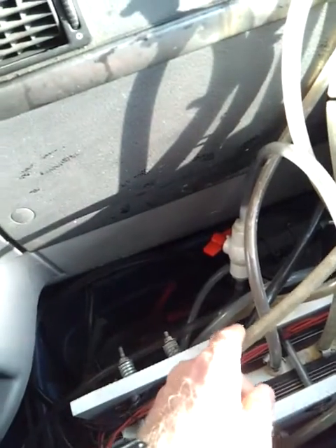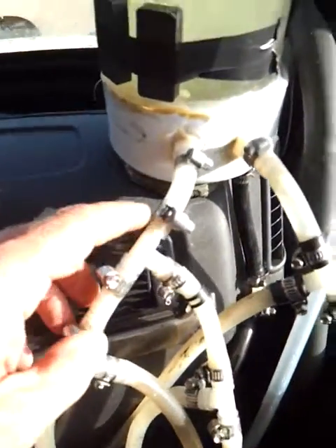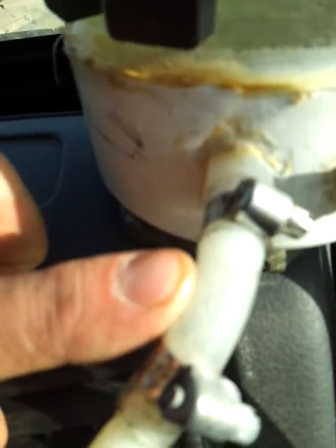I'm really impressed with it. For using magnets, you have to have the magnets where the water is moving the fastest, because that way the minerals — in this case the potassium hydroxide — are affected by the magnetism. If you're using it in standing water or a standing solution, you have to pulse the magnetism into it, like the saltless water softeners that use 60 Hz pulsing in pipes. Because of how it feeds out, each individual line is a fourth of the total output, so by the time they all join together and come into the tank, the fastest-moving solution is right here, but I didn't leave myself enough space to put the large magnets.